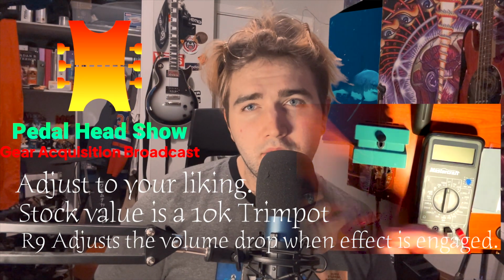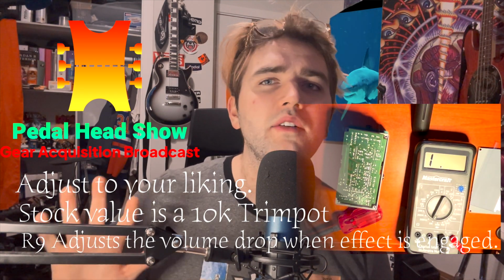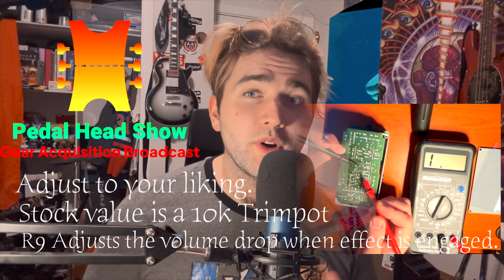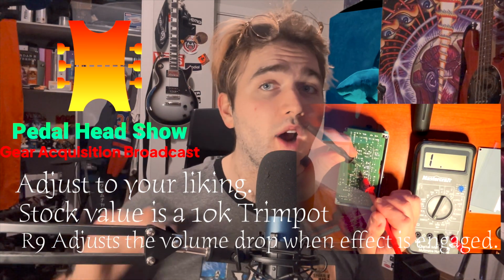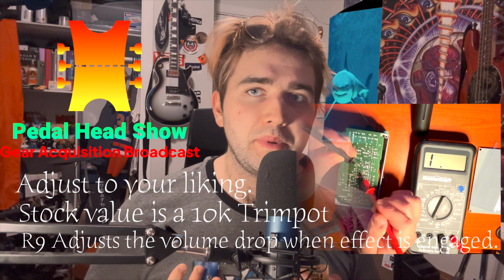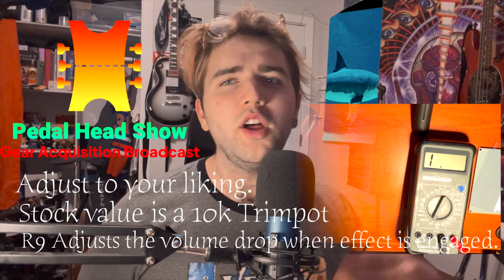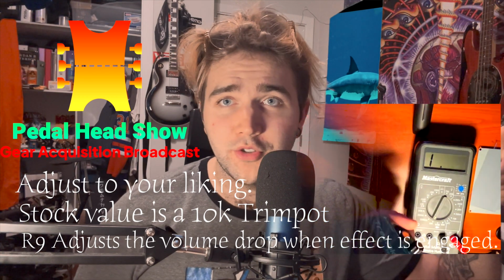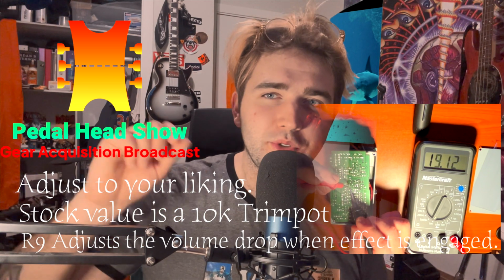Set your multimeter to 20k ohms, touch the 2 points, and you'll see a lot of numbers. The numbers you want to pay attention to are anything under 10. If it's 10 or under, that's what you're going to be manipulating when you turn the trimpot with a screwdriver. All you'll need is just a flat screwdriver. Not a Phillips, just a normal flat. Not anything that's hard to find, just a simple screwdriver.